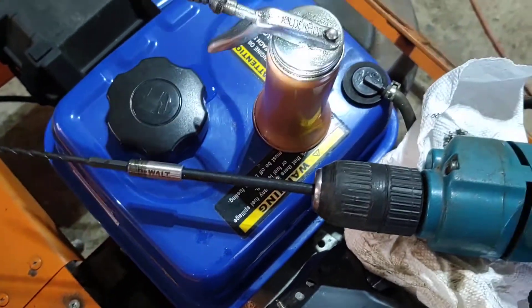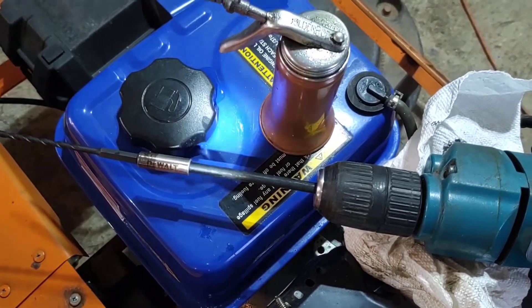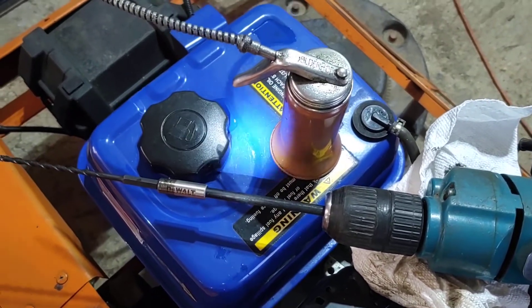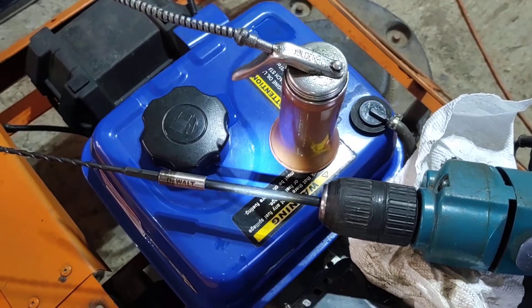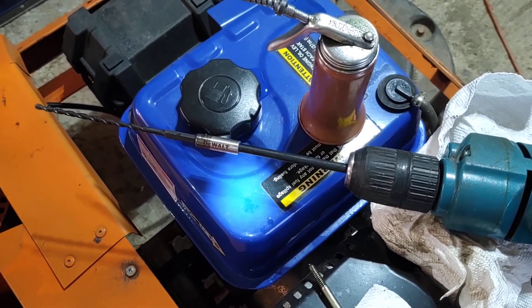I've got the extension, tons of oil — you've got to use tons of lubricant — and a good amount of pressure. But if you need to drill hardened steel, that's the bit to go to. Just don't overdo it: nice and slow, and steady wins the race.